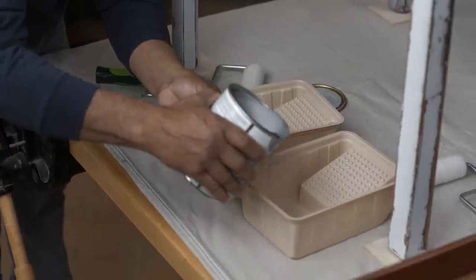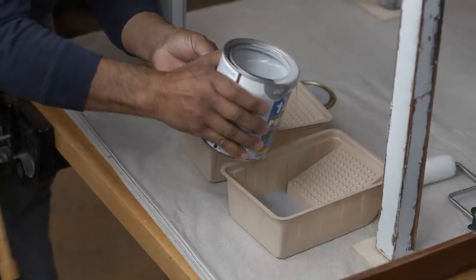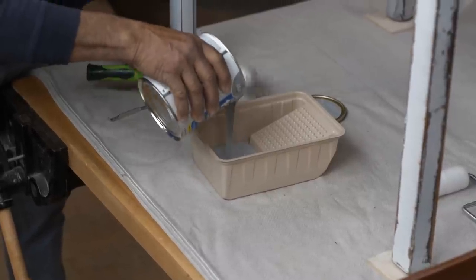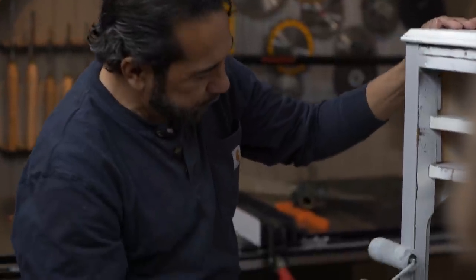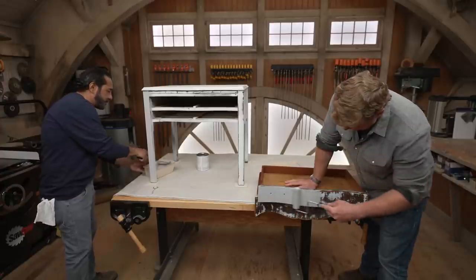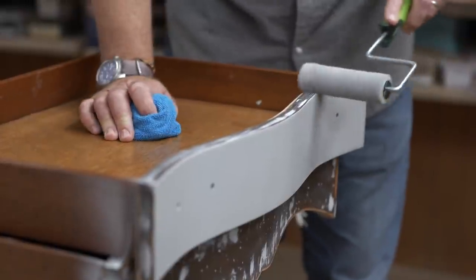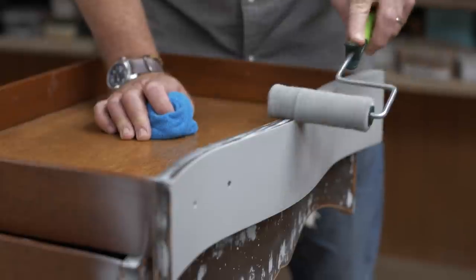Time to prime. Just a basic primer? Just a latex? Well, what we're using here, Kevin, is a water-based primer — you can also use it interior and exterior. We're going to apply it with this mini roller, which is four and a half inches long by three-eighths inch roller nap. No brush? The roller will give us a nice smooth finish, a good foundation for the top coatings. The roller works great on these drawer fronts, and we can get a lot of work done with those mini rollers.